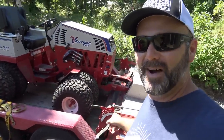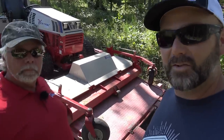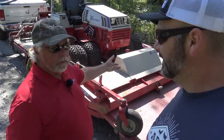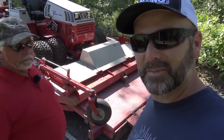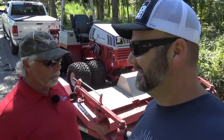Here we're looking at the 4500Z, and Rob is going to tell us about this new prototype deck. I'm calling it the monster mower — the real name is the NK960 model. It's an eight-foot mowing deck, which is quite uncommon in the commercial mowing industry because it's so big it's liable to scalp. But it has anti-scalping wheels on the front, and a full rear roller, with anti-scalp wheels under the deck as well — the first time I've seen that design. We'll get to keep it for a couple of weeks to do the driveways.